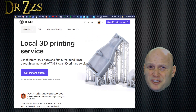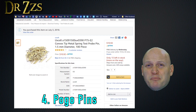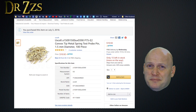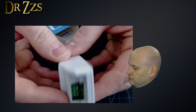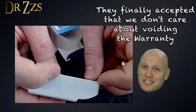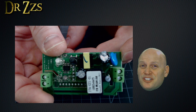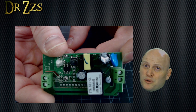It just doesn't make sense to pay $30 in shipping for a $2 plastic part. With Mark's Sonoff Basic flashing clip, you're also going to need some pogo pins. Unfortunately, I couldn't find a small pack, so I had to buy 100 of them — hopefully we can find some other uses for them. Here's the Sonoff Basic. These new R2 versions don't have the QC sticker sealing the box anymore. The most important thing about the new R2 Sonoff Basics is that the serial contact holes are soldered closed, so you can't just slip the end of a male jumper through the hole anymore.